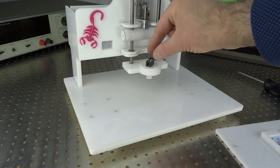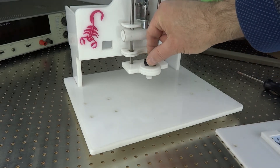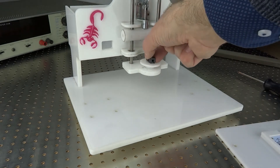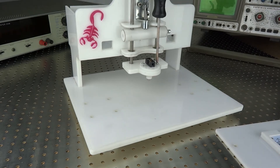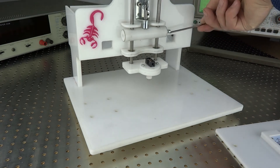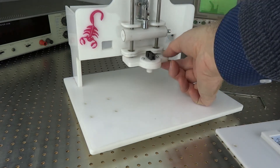The programming head can be rotated in steps of 45 degrees around its own axis, with an additional plus or minus 5 degree fine-tuning setting. The vertical head feed in the programming device allows 5 mm of up and down movement. The zero position, or contacting height of the programming head with pogo pins, can also be adjusted by 30 mm.